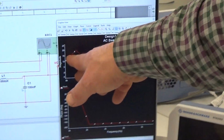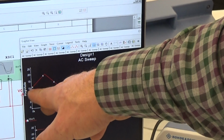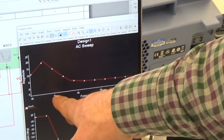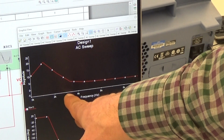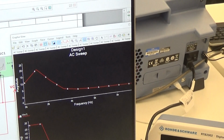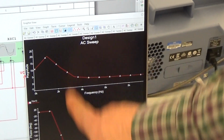Yeah. So what we're seeing here is the Chebyshev kind of response, followed by a much more rapid decay here. So you see, you've got the same kind of drop that you had before, but it's happening over a much lower frequency range here. So what we've done is those two reactive components have actually created a faster cutoff filter. So ideally, a filter would just be dunk, and then nothing.